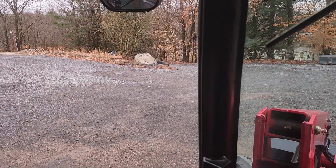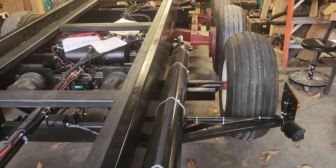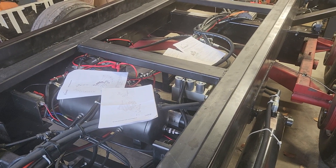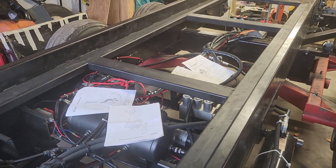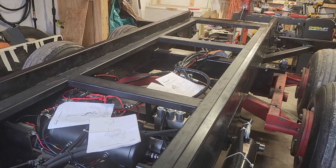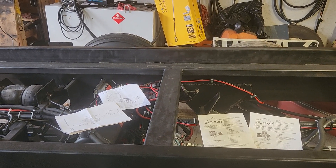It gets all its power from the tractor through those switches to operate the solenoids — there's no external power going to the solenoids, just to the switches. You have power to hook up and then there's kind of a messed-up lead wiring thing — just pay attention and you'll see when you cut the wires which one's ground and which one's not. It had multiple colors: one black ground, two whites, and then positives were green, blue, and orange or yellow.